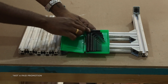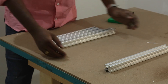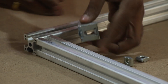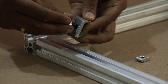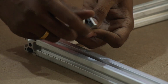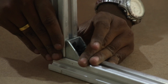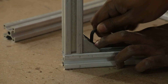I am using this Allen key wrench made by TVS — they are supposed to be the best. The base is built with these four pieces; the long pieces form the sides and the short piece goes in between them. This is a corner block — as the name implies, it fits on the corner joining both pieces. To fasten it, I drop the Allen key screw and attach it to the T-nut, held loosely so I can slide it in the T-slot. The other aluminium extrusion slides in from the other side, and I make sure it sits flush to the end of the other piece.